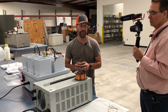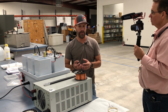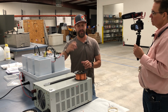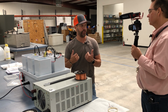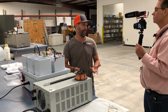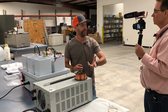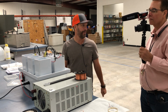the amperage. There's a few baths that are specific to amperage. One is palladium. When you use palladium, you want to stay at low amperage, something like 1 amp. If you go much above that, the surface will become frosted. But generally our tech charts will tell you what the suggested voltage is to get that amperage. Occasionally you'll get a tech chart that'll say operate at 1 amp. And then once your part's in there, you can lightly adjust the voltage until you hit that 1 amp mark.